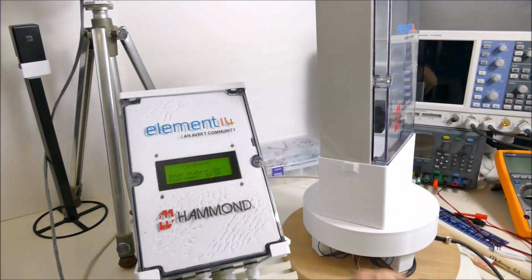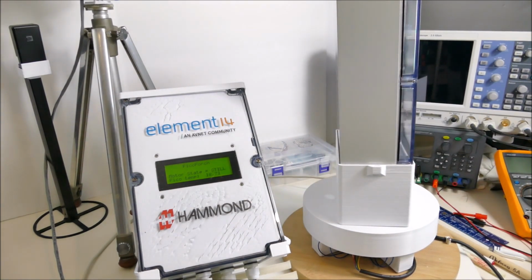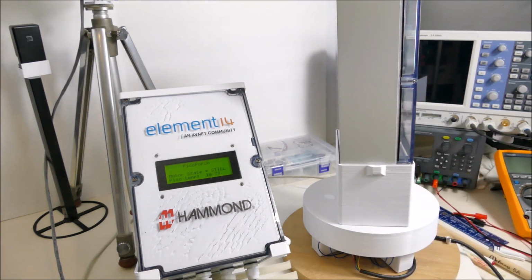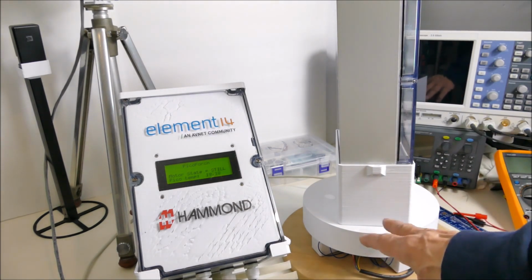Ultimately, when I get a Pico W in there, I can control that from my phone and dictate the angle it's pointing. But until that time, I'm just running the Pico open loop, and it's periodically rotating to different angles. But it's great. All of the hardware is working. The limit switches are in the right spot. They stop the rotation when they need to. There's no interference. The tolerances are all good. So the mechanism is working properly. This thing will even shield from rain falling onto the gearbox.